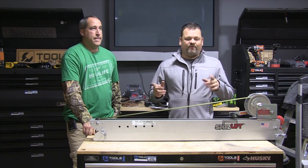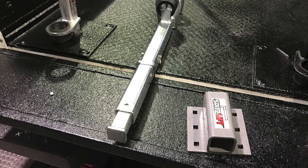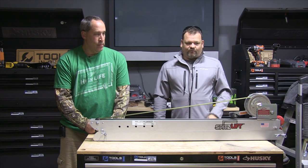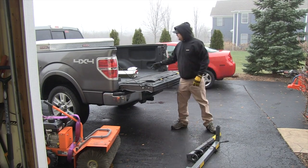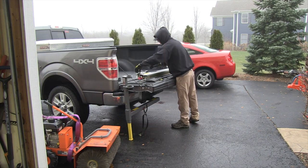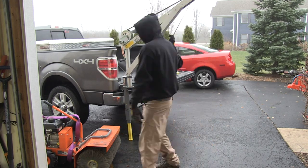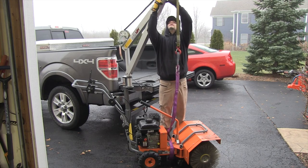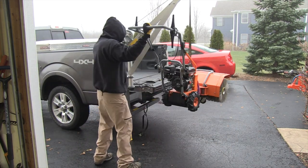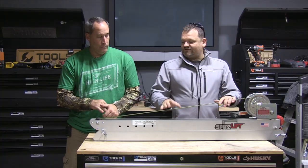There are all kinds of different ways you could use this. We're going to use it as a pickup truck crane, but I also want to figure out a way to use it with a van or trailer — for areas where I can't take my truck but need to lift or swing things around. Up to 700 pounds, and even with 700 pounds in the air it just turns so easily. Be careful on inclines though — if this thing lifts weight on a crazy incline, it's going to want to swing toward that incline. Always use it on a flat surface, and on an incline I'd totally recommend getting a second person.